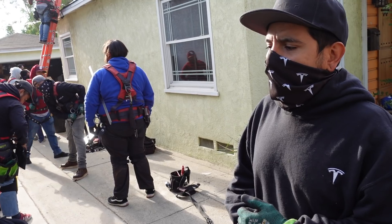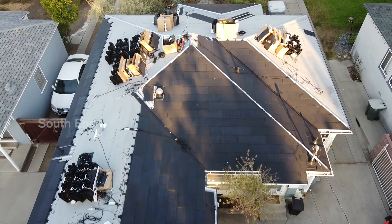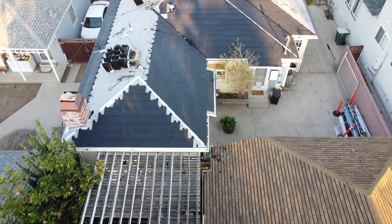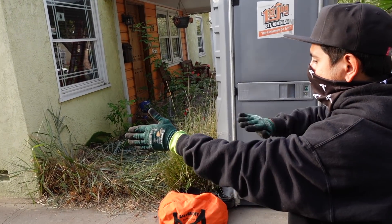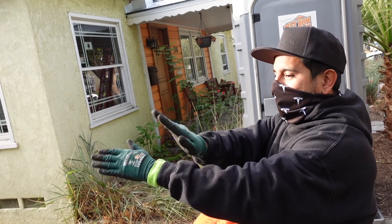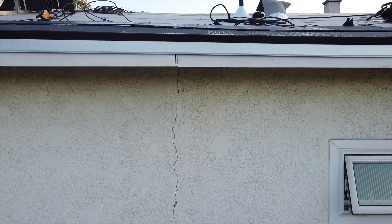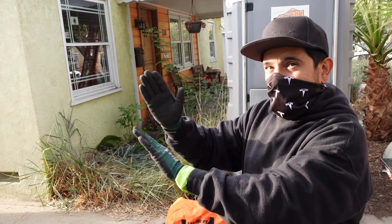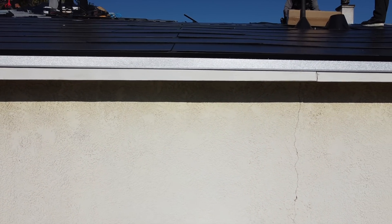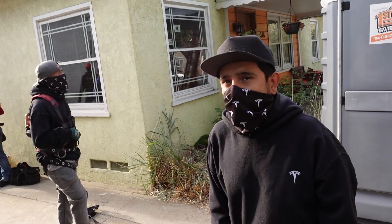We noticed that there may have been a remodel at some point of the house — it's on the south end where the hip extended to the back portion of the house. It looks like that's part of the extension. Just giving you a heads up: because it's not level and it's pretty significant — it kind of goes flat and then gradually declines — you may see a bit of an inconsistency based off the stagger of the way the tiles are installed and the footing, and that's just solely off the way the home is built. That's something that's just completely out of our control.